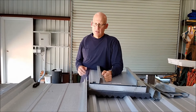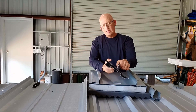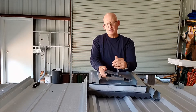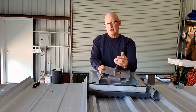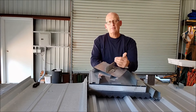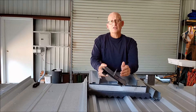The other structural standing seam type is a two-inch tall vertical rib panel. This will have a double lock seam on it, just like the trapezoidal panel. These are used more for applications where you've got hips and valleys, on steeper slopes — minimum half inch on 12 slope. Both of these panels have two-piece clips, so they only move so much. The double lock seam makes them watertight with good wind uplift, but it makes it very difficult to make a repair at a later date.